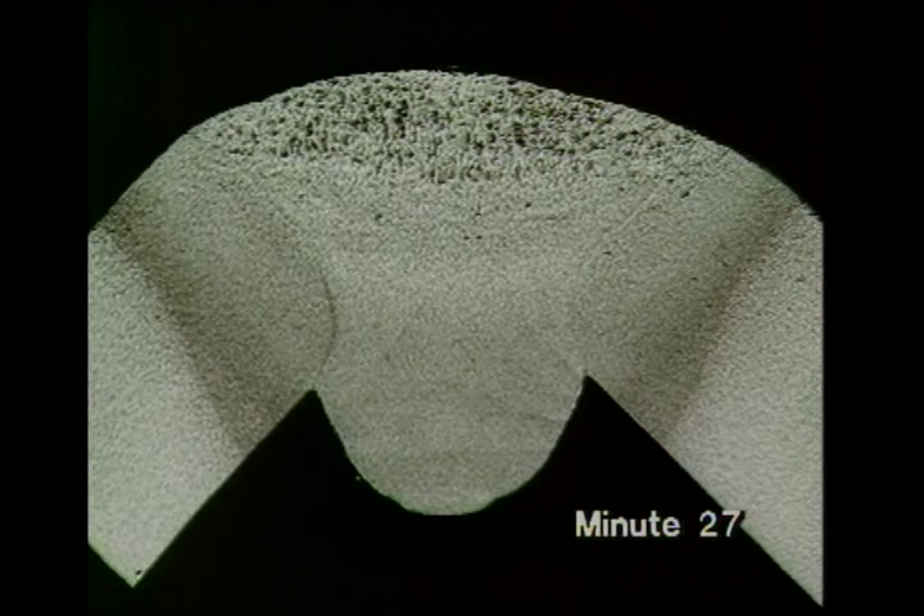The macro section shows that the weld metal fills the joint with a reasonably smooth top and bottom surface. On the other hand, if the plates were overlapping before welding, the weld hasn't penetrated right through the joint. Here, the gap was too big, and the molten metal has penetrated too much — in fact, it could have melted right through and left a hole.